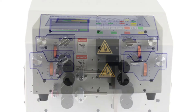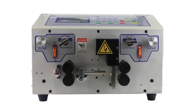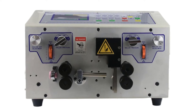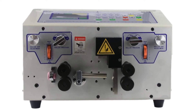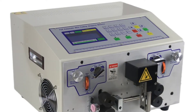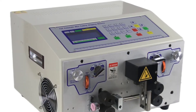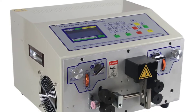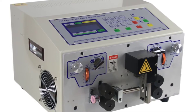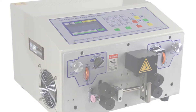The SWT-508MAX-25 is designed for 16–25mm² unshielded cables, PE and PP insulated cables, flat and round wires. The machine adopts a one-piece clamping structure with multi-position adjusting to ensure stability of cutting. The new designed blade allows quick and easy blade changes, and the machine is equipped with a light control system for the best cutting performance.